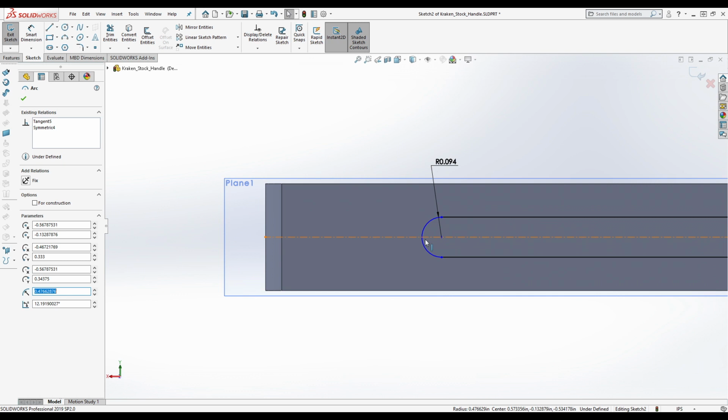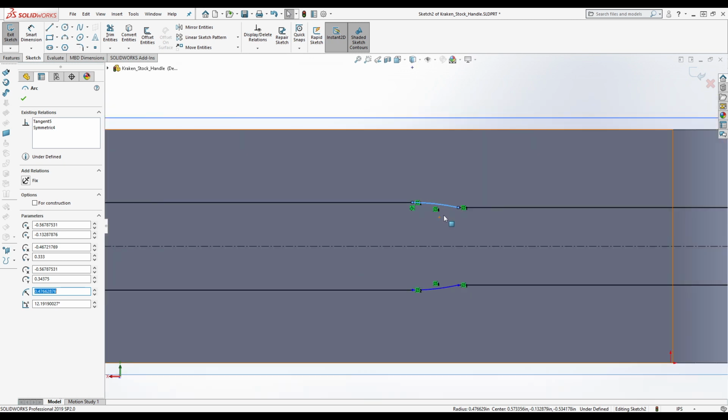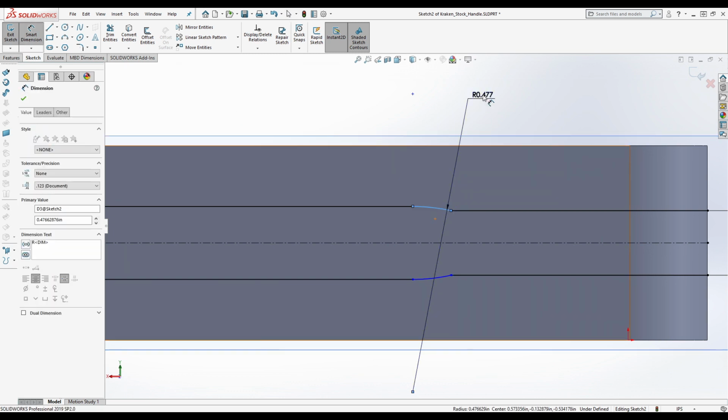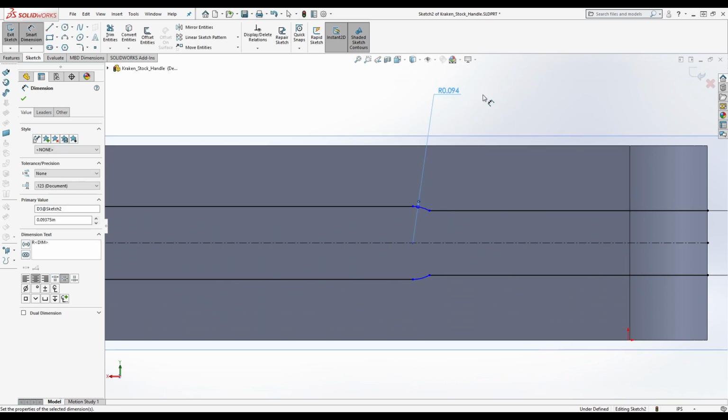Although I suppose it doesn't really matter that much. I mean, even with this small of a change in the difference in the diameter of the tool versus the diameter of this cut here, you're still going to have a pretty hefty tool engagement. So I suppose it doesn't matter. Maybe you would just do 5/32 here. But I think that 3/16 would be a better design anyway. So we're going to go with 3/16 over 2. Or wait a second. Yeah. This is the radius. Okay.